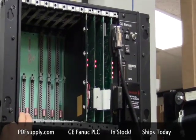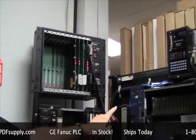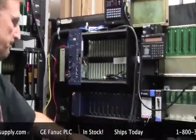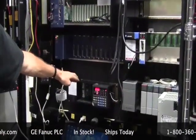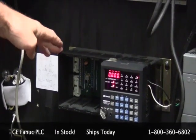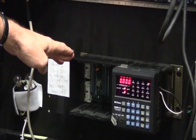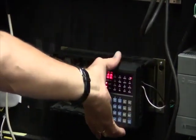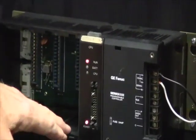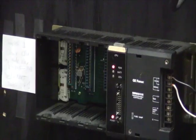The second product to follow the Series 6 was a much smaller and one of the first modular PLC systems, called the Series 1. The Series 1 was made by a company Koyo for General Electric. It consisted of a 5-slot or 10-slot rack, was capable of being expanded, and consisted of a CPU, programmer, and power supply with multiple I/O cards. A ribbon cable would expand it to additional racks.